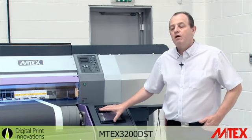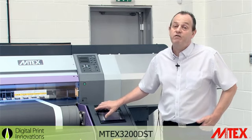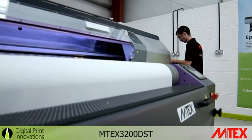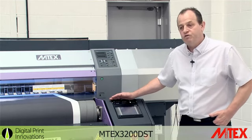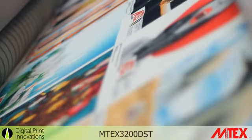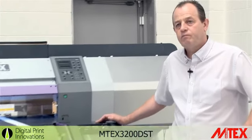Other possibilities are that you can actually turn the back heater system off. We have some fabrics now which are self-adhesive, so it means that the liner doesn't become burnt or damaged. It means you can put self-adhesive fabrics or textiles through the machine — and I believe that is unique on the Emtex. The heater control is very advanced on this machine. We can actually select which areas we'd like the temperature on, from outside towards the middle, so for narrow uses of media we can turn off the outer heaters to control temperature. It also has thermal pickups to maintain temperature within the machine, and has separate heater controls and thermostat pickups for the outside to combat heat loss to the frame.